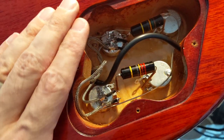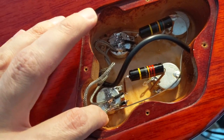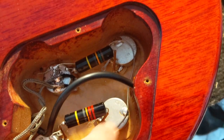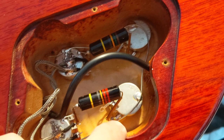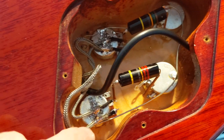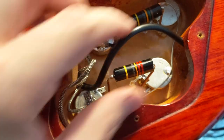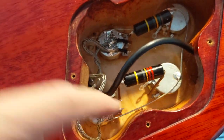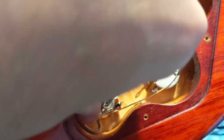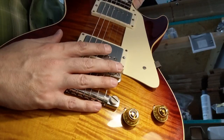These are installed — not the prettiest soldering I've ever done, honestly. These pots are really hard to solder to. I replaced the tone pots and you can see how much easier the smooth back of a CTS pot is to deal with compared to these printed pots. The output jack is back in, there's some extra length for the bridge pickup, but it's all connected. Let's tap these pickups and see if they work.